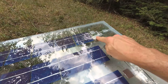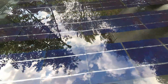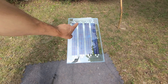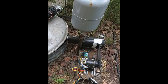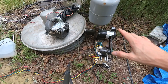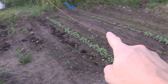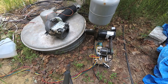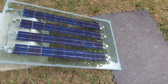But I figured out a way of getting them to tab easily and I'll show you that in the video. In this panel here I've just used aluminum tape to hold the bus bars down and I've used some hot glue instead of tile spacer just to give that little bit of separation between the glass. With the new panel here I can get 32 cells — I could have got at least two more rows in that glass. The batteries are running this 24 volt water pump that I built. This runs a water line 600 feet from this well over to the organic garden. Let's put this solar panel together — I'll show you the entire process.